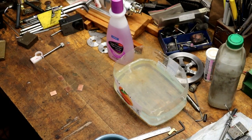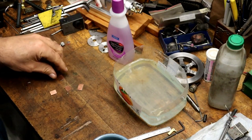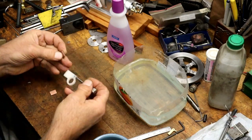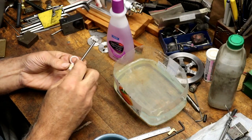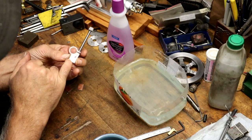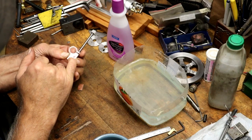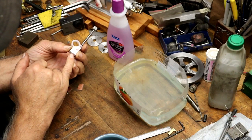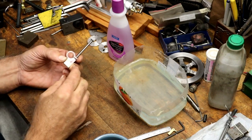I'm going to attempt to make some little circuit boards that will hold the hall effect sensor. This is the other lever that goes on and it will mount onto that little lever with a couple 4-40 screws. The hall effect will be mounted right there, the wire will come up, and I'm going to cut a little groove underneath to come up and around and then attach. That's the plan anyway.